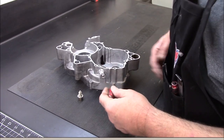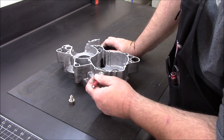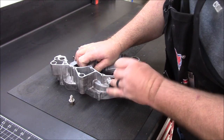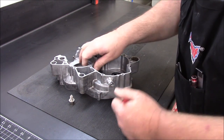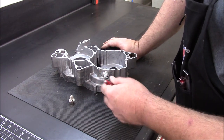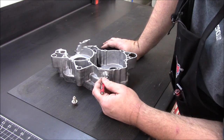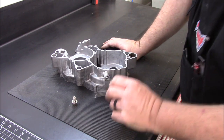So this is not too bad. This one here is just a drain plug for the transmission, but it looks like it's been repaired once before. I dug down in there and it looks like there's some JB weld, which I'm not a fan of using on these. I know people have done it with success, but in my opinion that's not really the right way to fix it. He sent me a new drain plug with it, and it looks like they tried to weld around the edge and then go into the threads and re-thread it.